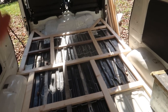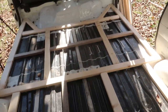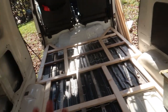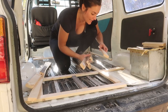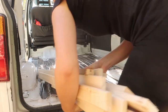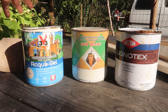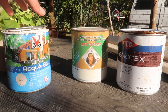The wooden batons are all nicely cut. I might have put maybe too many — I could have done without those middle ones — but better safe than sorry. I did run out of the nice wood so I had to use some scraps. Now I'm just going to give them a coat of protective varnish, leave it to dry, and tomorrow I'll be ready to attach them to the floor. I numbered them and took pictures so I can reconstruct the layout. For varnish I'm just using residues from the garage — a little bit of white, a little bit of chestnut — I don't really care because you're not going to see it, as long as they are protected.